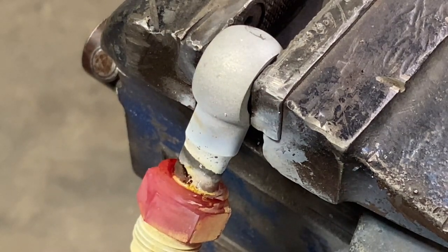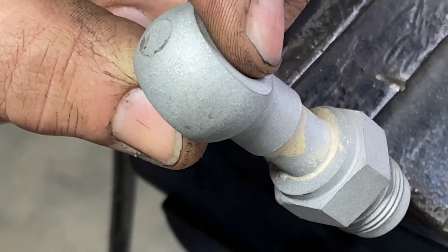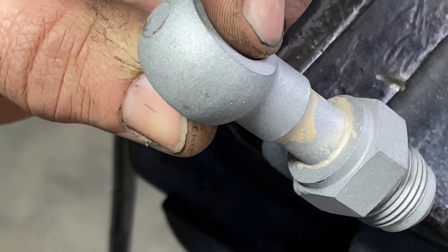I got lots of silver in between the two. The capillary action just sucks that silver solder in — it sucks the flux in, everything. We'll just let that cool down and give it a blast. Here's the fitting after it's blasted, and this silver solder — you can actually see they used it on the factory to put that stub into the banjo fitting.